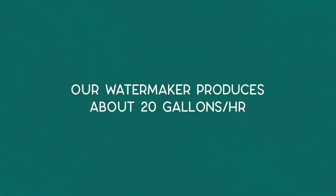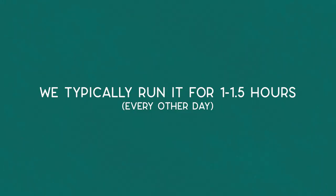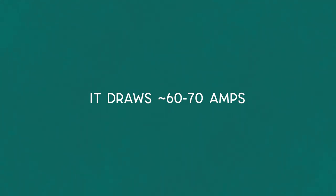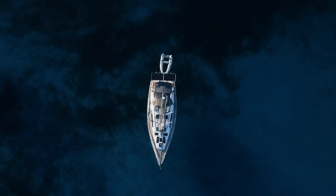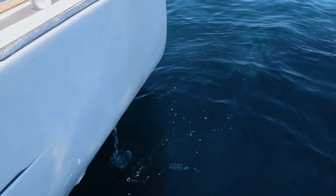So how does it perform? Our watermaker produces about 20 gallons or 60–70 liters per hour depending on the temperature and salinity of the seawater. We typically run it for about 1 to 1.5 hours every other day. It draws 60–70 amps with our 12 volt system; however, we try to time water production for when the sun is at its peak. With our solar array pumping in 30–50 amps at peak sun, we normally draw 20–30 amps from the battery when the watermaker is on. We've used it in clean ocean water and extremely dirty lagoon water of St. Martin with great success, though Sophie has asked me to tell you that you really shouldn't run it excessively in gross water.